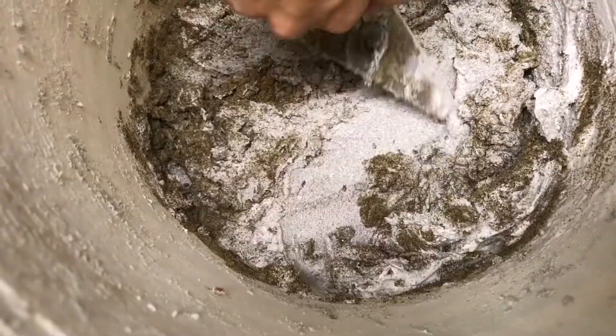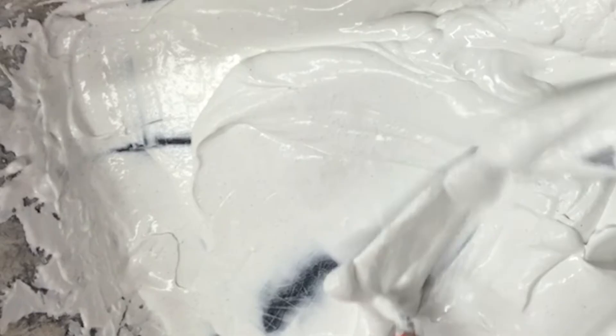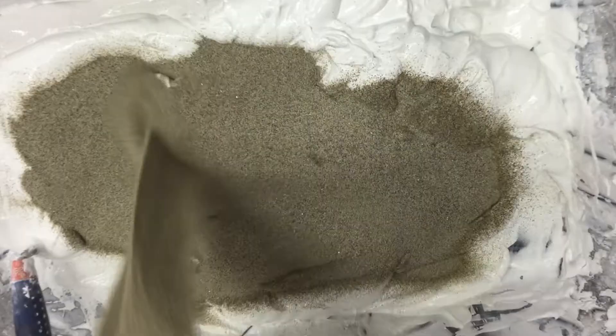The terracotta brick wall is properly brushed and washed to receive a first layer of very rough mortar, made of one part lime and three parts coarse sand or other inert particles of large granulometry. This layer is well beaten with the float and left very rough to ensure the grip of the next layers to the masonry and the stability of the entire work. On this first coarse layer called 'rough cast,' we spread another layer called Arriccio — sand finish — still rough, repeating the same operation.